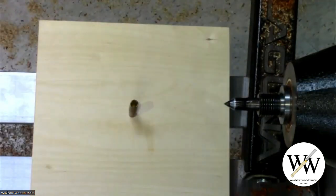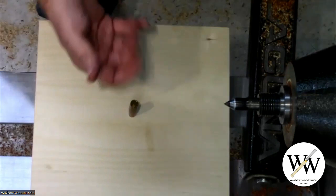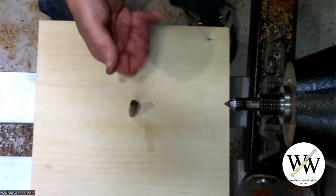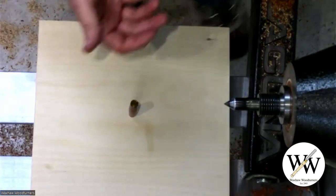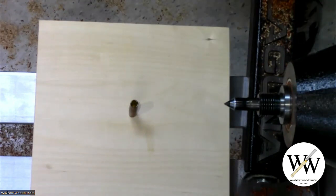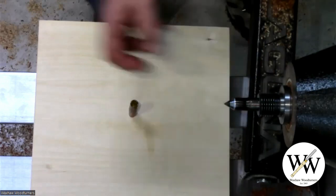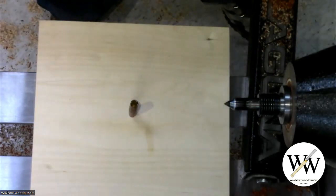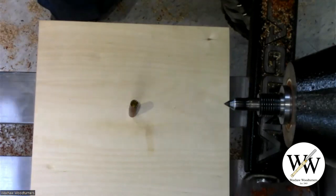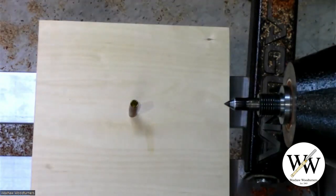So when it comes to assembly, you've got a couple of different options as well. One of them is you can use those Irwin quick grip clamps. You can actually use your lathe. You put a waste block on your spindle and a dead center that's not pointed on this side. You can actually use this part to assemble your pen blanks.